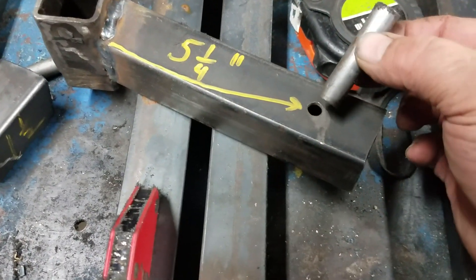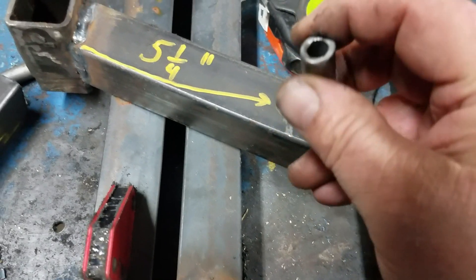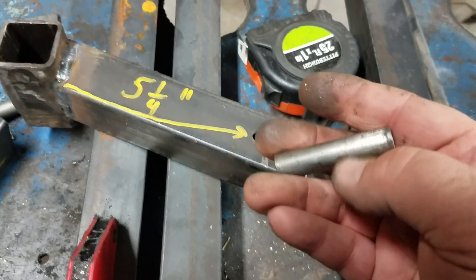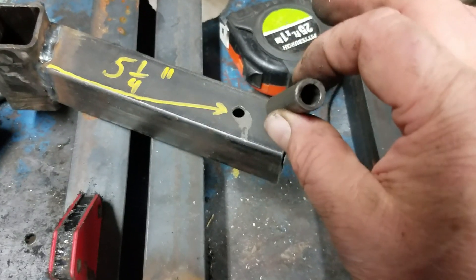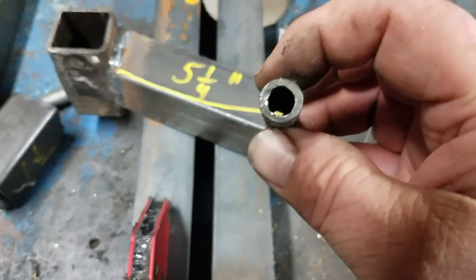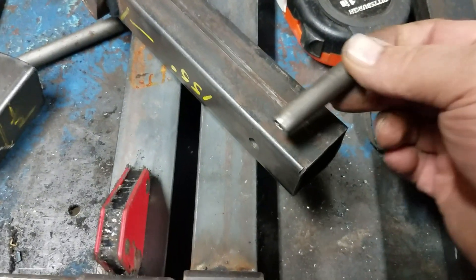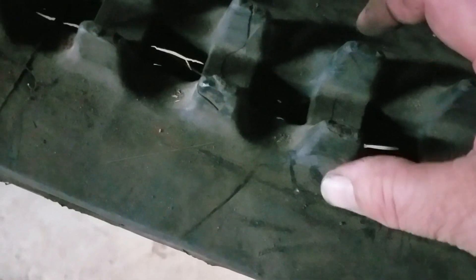From there I'm going to drill an even bigger hole, because I'm going to insert half-inch round tubing with a five-sixteenths-inch inner diameter. My bogey wheels have five-sixteenths hubs, and these axle housings are about two-and-a-quarter inches long — they stick out just a little bit. You have to have enough distance to span the track lugs, with the bogeys running on either side. So with that little axle housing, the bogeys have to run on the outside of these cleats — that's the way I did it.